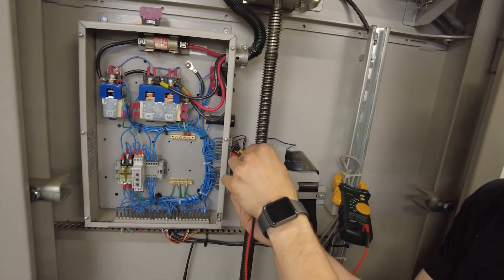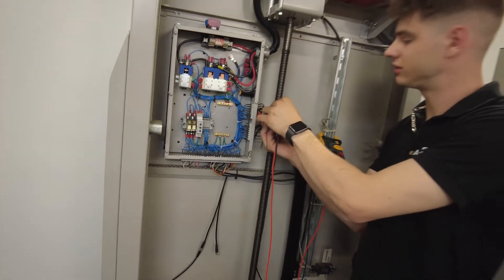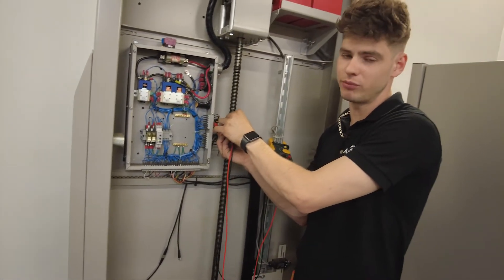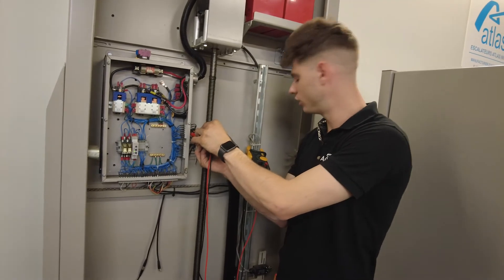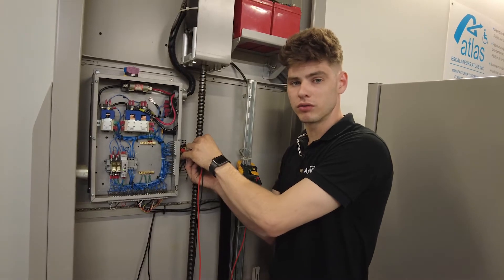Right now I have a constant beep through these two circuits, which means my safety pan is closed and that is safe — so it should be able to come down. If it were open, it would say OL for open loop on your meter, and then we would need to check the following.